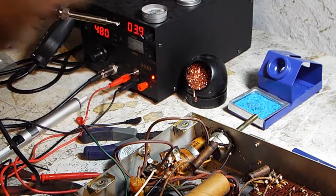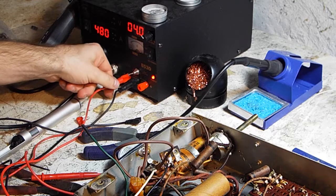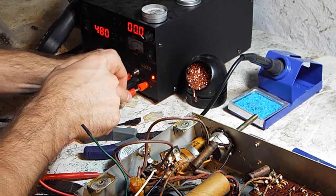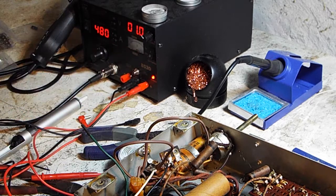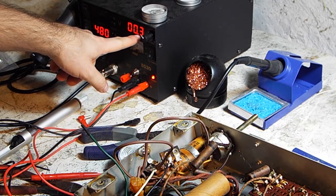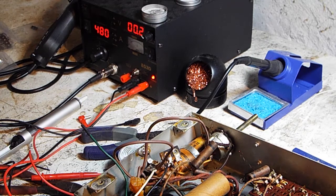Okay. He's in there. Alright, so we've had this in here for good enough. We will switch this to that, and we will test our voltage. Yeah, so considering how fast I switched that over, that should be reading 4 volts. That should not be dropping as fast as it did. So essentially that thing's leaking everything it has extremely fast.